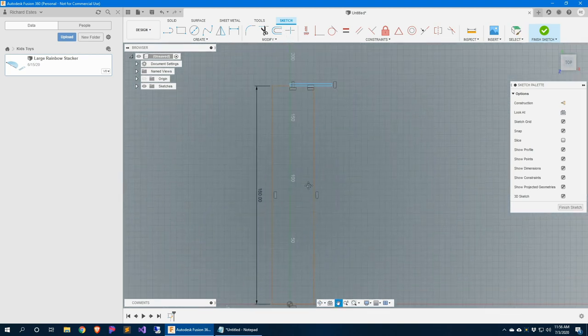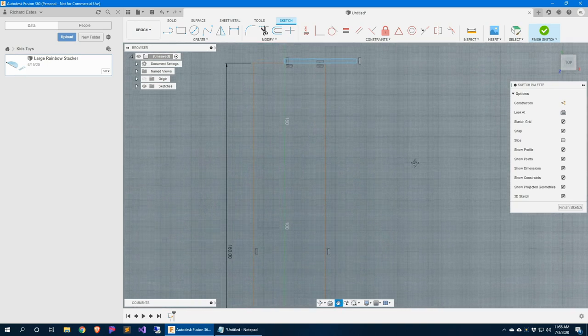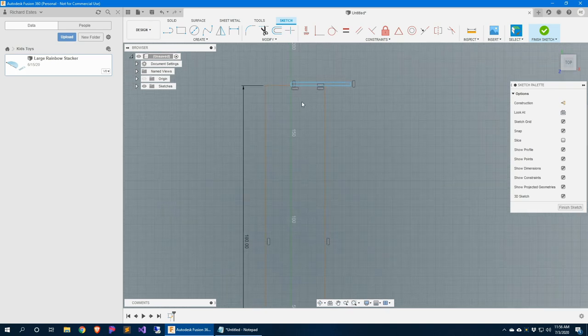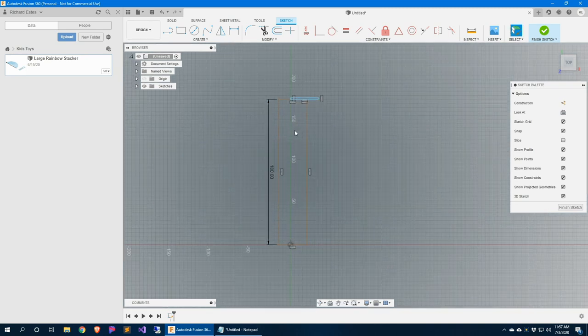So what I need to do now is account for each of the other circles leading up to this or down. A couple different ways I could do that. I could go through and draw a bunch of arcs, get all my circles, and that would tell me where each one would fall. Or I can just measure, because if I do 180 I actually want to subtract 2 millimeters to give me a little bit of room for the blade cutting. So what's left over, I want to be as close to 1 centimeter thick as I can. If I were to do it exactly 1 centimeter, everything would end up being closer to 9 millimeters. Not a big deal, but I still want to try and keep them at least a full 10 millimeters. So I'm kind of gonna work backwards. So this is the longest one, and our shortest one is gonna be up here somewhere.